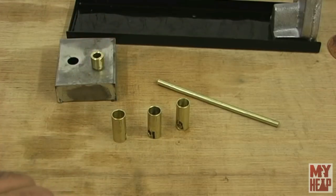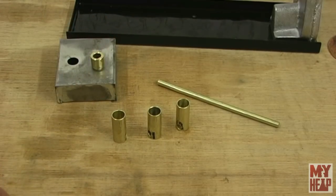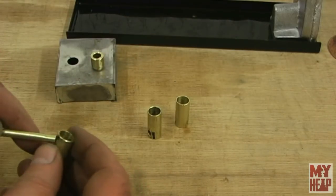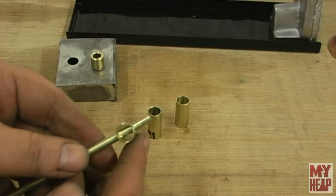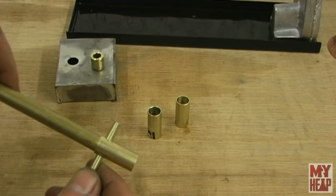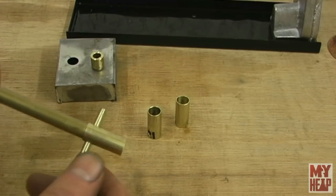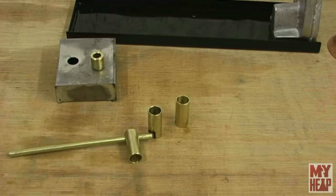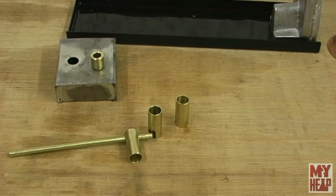The wick tubes have been drilled, and they fit on the pipe. So now I need to make some bottoms. If we look at the wick tube as it goes through the pipe, it needs a bottom on it. So that calls for a piece of 3/8 brass. So I need to slice off some little discs of 3/8 brass. And it should be a challenge for me. I'm going to grind an angle on my cutoff tool and see if I can get the cut piece to come off first before the pip, and maybe give it a little sharpen too.